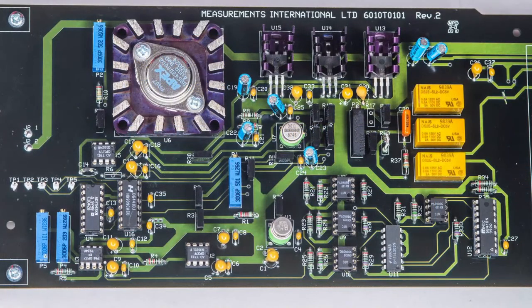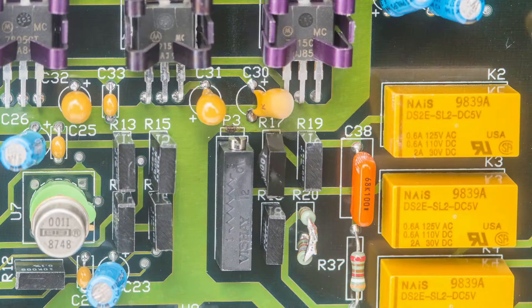So then I took it apart, looked at the board, and this was one of the, it's actually IX current source. And then I found this R17 right in the center. It's Vishay S102 bulk metal foil resistor. It's supposed to be 100 ohms, 0.1%. But as you can see, it doesn't look very good. It has a big bulge on the side. And also when I was taking the covers from the bridge, I smelled a deep, uncomfortable smell of burnt electronics. That is never good.